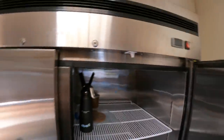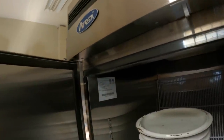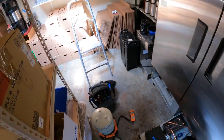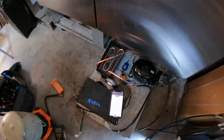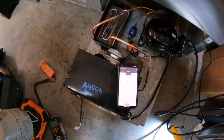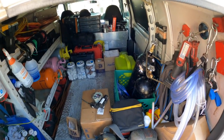All right, while we're on the vacuum pump, I'm checking the door gaskets. They look good. Door gaskets look good. 13.4 ounces. Already got it marked. We're down to 800 microns and dropping. Yep. All the units on the vacuum pump pulling down.